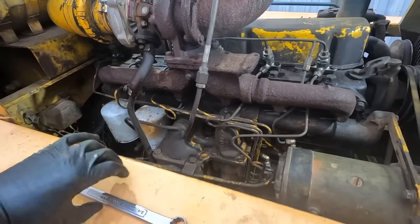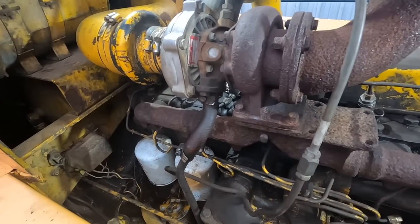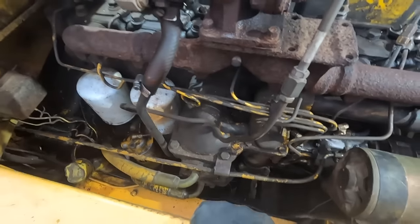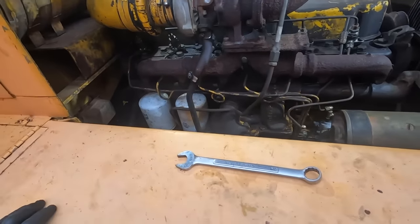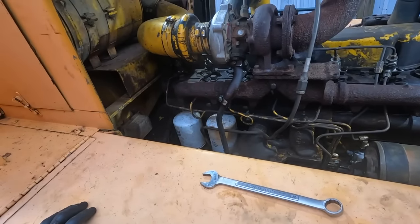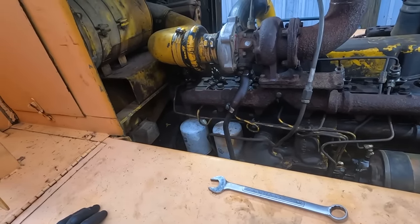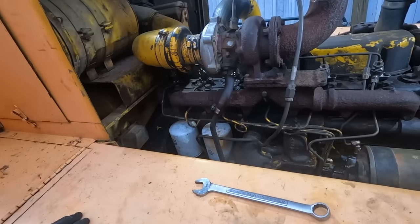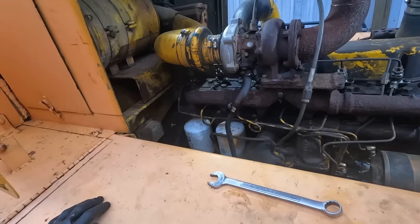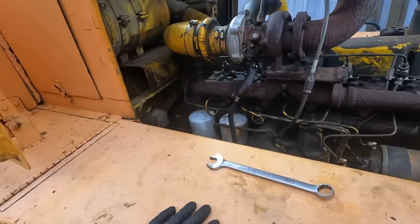I'm kind of thinking we're low. And I don't have my third jumper pack here. Kind of wondering if I give it a little ether and just try and pull a prime with ether. I've done it before when I've had low battery, so maybe we'll do that just due to the battery situation we're dealing with. Crank it.